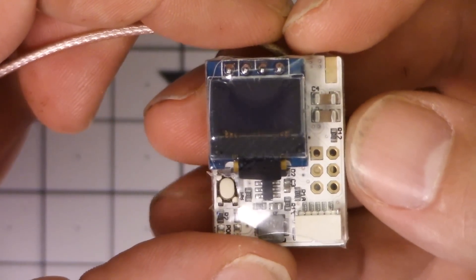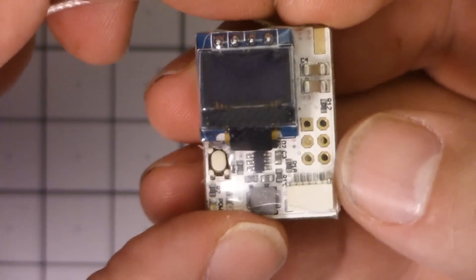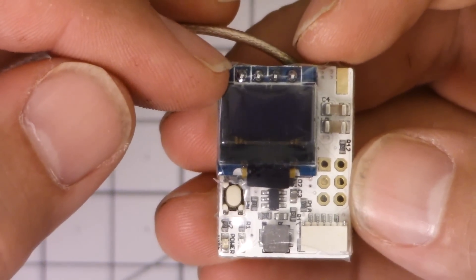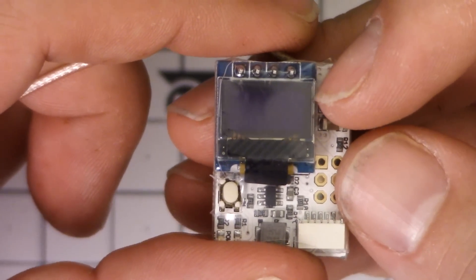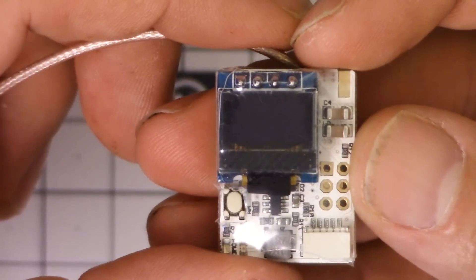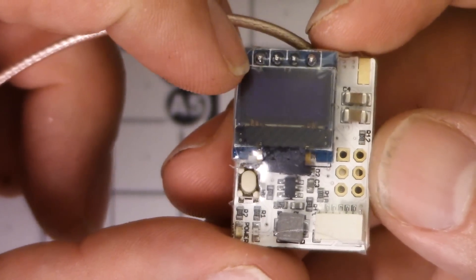And that brings us to the final component of our build — the video transmitter. This video transmitter is not for sale yet, it's in development, but I've got approval to show it. This is from UBAD, the guys who make LaForge and many other things. It has a built-in OSD that shows video-related stuff like channel and transmit power, but also your timer, call sign, and battery voltage. The one critical thing it's missing is current reading, but I can live without that if it means getting an OSD without adding another board to my stack. If I end up making the RROSD work, I'll just use a regular video transmitter like a TS5823.